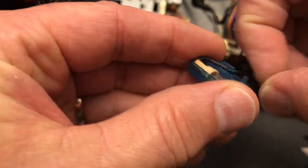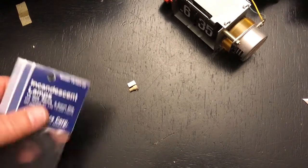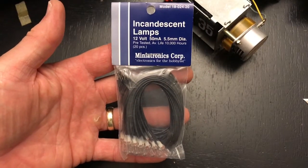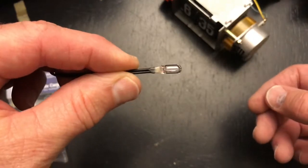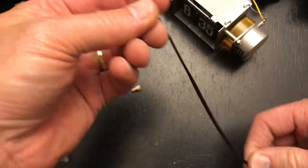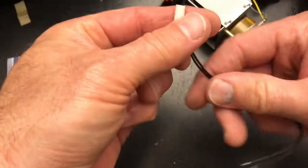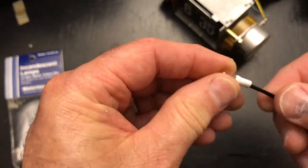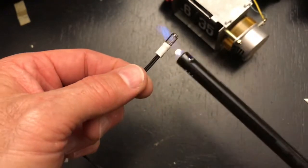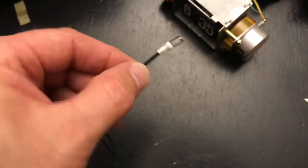Here's the little holder and it's blue so that the yellowish incandescent light turns white when it filters through - that's before LEDs. Here are the actual lamps I use - this is the exact replacement you can get at hobby shops or on eBay, just search by the name and number. It doesn't look exactly the same as what we're replacing, so you put on some shrink wrap tubing - that's all it is. It helps it fit better and look like the exact same thing. Use the blue part of the flame when shrinking it, not the yellow - the yellow will smoke and blacken it.